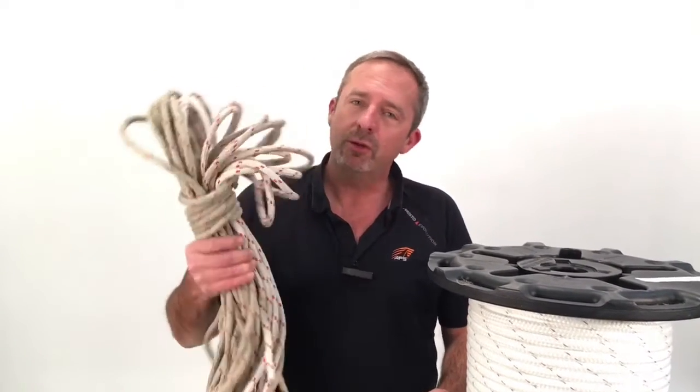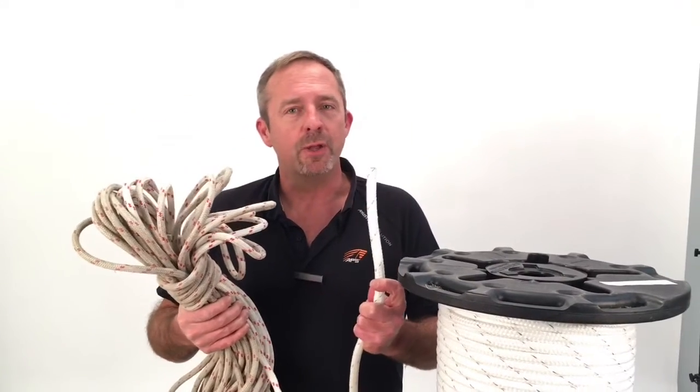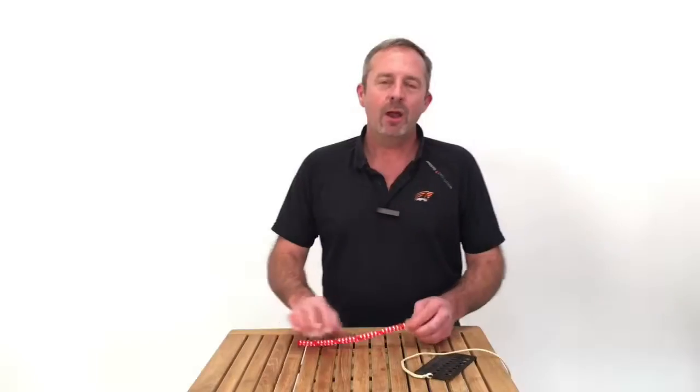Hi, this is Kyle from APS, and I'm going to show you how to measure the diameter of braided line properly with high confidence on both used line and brand new line. Okay, the first thing we need to do is set our expectations around line diameters for braided lines.